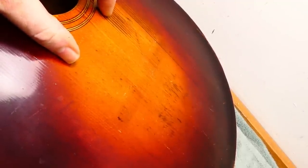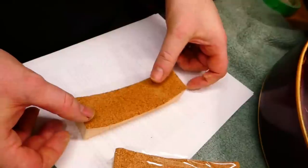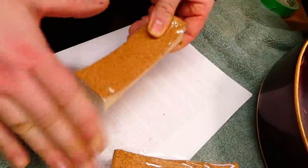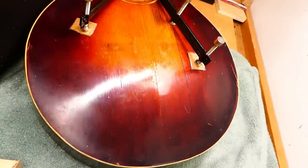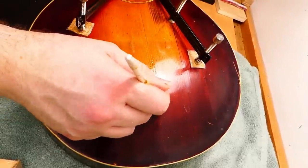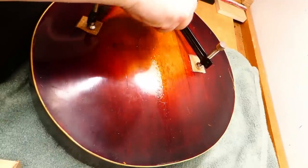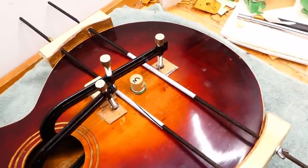There's no bracing in this guitar that crosses the soundboard, except for one tiny little brace right here in between the two tone bars, which run parallel to the strings. So there's a big open expansive top in here. I'm going to have to get some glue in and some cleats and make sure this is level. For those who like to build clamping cauls quickly and use contact cement to hold on the cork, it's a good idea to add some packing tape as a barrier if you'll put them into use the same day — otherwise the solvent in the cement could damage the finish. I'm using fish glue in this case, a generous quantity, which I'll paint on and into the crack, then pump through with my little suction cup and clean off the excess with a damp paper towel. I've got clamps to keep the soundboard in alignment and others to pull it together.